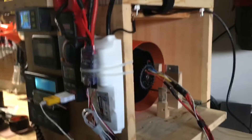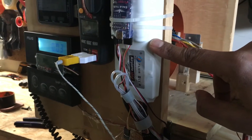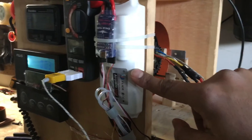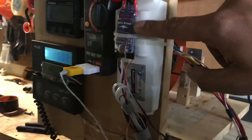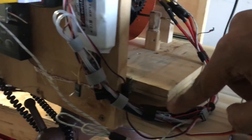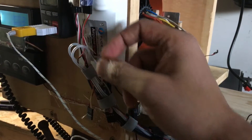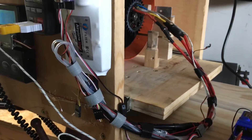I've got my ESC here. This is capable of up to 320 amps and 22S, and I don't think I'll ever need anything greater than this for bench testing. Here is the Eagle Tree on top of that. This is all the wiring that runs to the back of the motor. The clear tubing is for the airspeed sensor, and then obviously all the wiring for the motor, the temperature sensor, and so on.